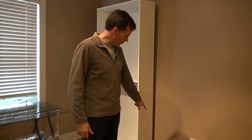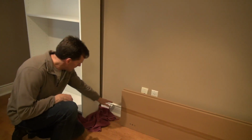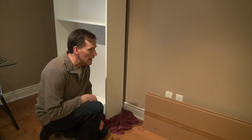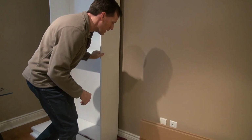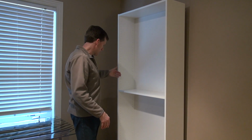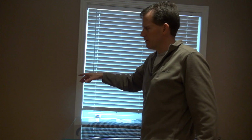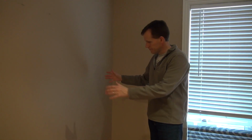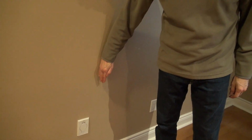What we're going to do is remove the baseboard down here. We're going to raise these up, put the baseboard around them, and we're going to get two of these size. So we'll have two of these, a corner, a half one there, and then on this side we'll have the mirror image. We'll have the little half one, and then two full-size ones again. All raised up to the height of about 5 inches, which is the baseboard. And it actually should bring us to, I think it's right around here, so we don't worry about our vacuum.